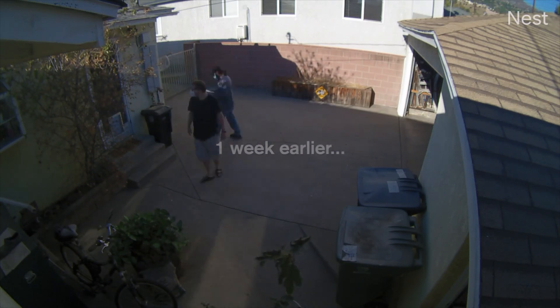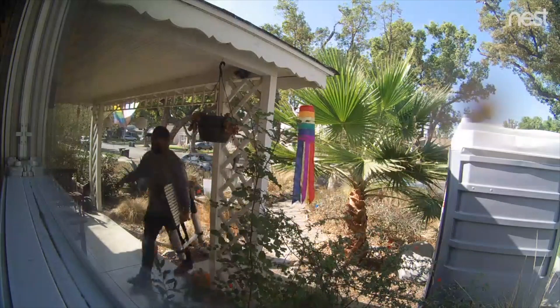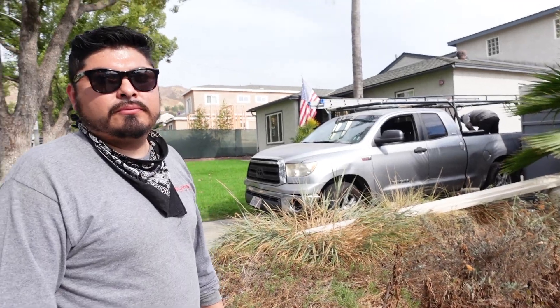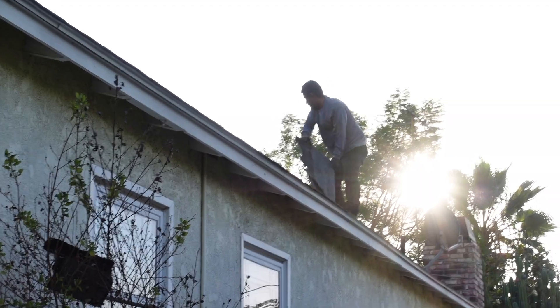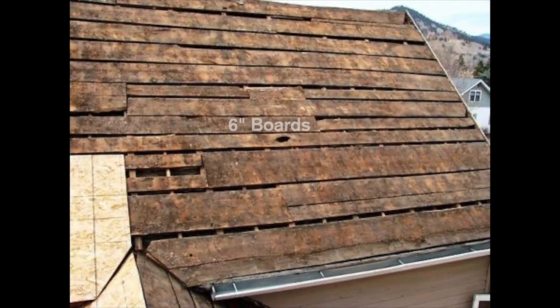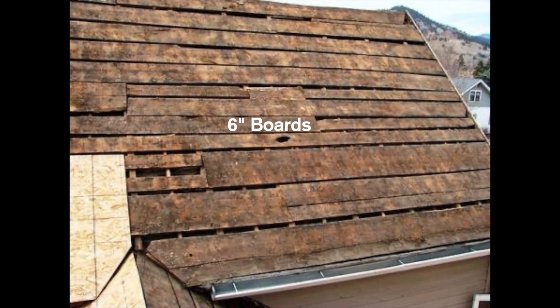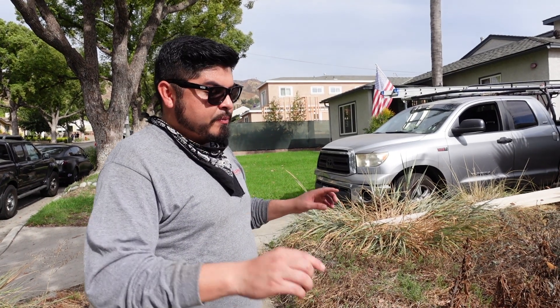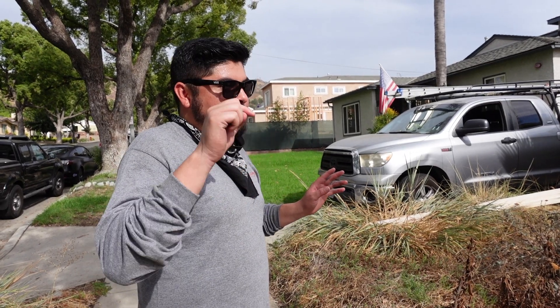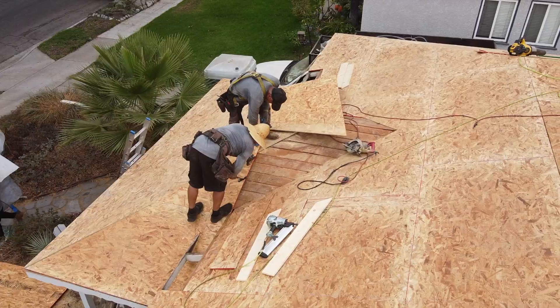So far I had two visits of the Tesla foreman and then also the subcontractor to just look at the roof and see how they're going to do this. Step number one: tear down. Step number two: putting the plywood there. The actual front portion of the house had one-by-six boards. The Tesla roof can't have that — it has to be sheets of plywood because there's a gap at every six inches. Whenever you're going to install the glass itself and the mounting plates, they might end up sinking and lining up with the gaps and it's not going to perform — it's going to start moving. So that's why we sheeted the front side.